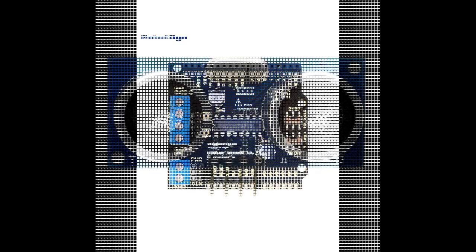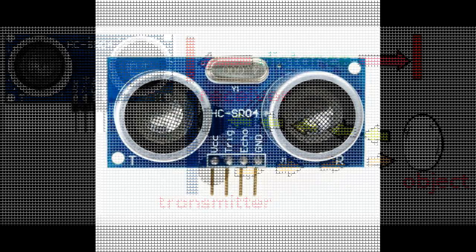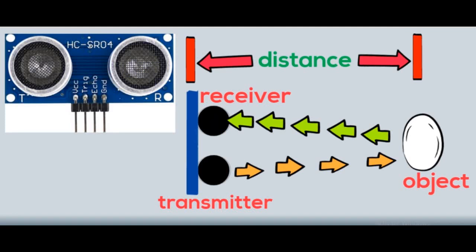As sensor, we use the HC-SR04 ultrasonic sensor, which detects the distance by sending sound pulses and calculating the time of the waves turning back to the sensor. This is used for the robot's gap detecting system. When the sensor reads a farther value than the value we set, it means the sensor is above a gap. Otherwise, the sensor does not see a gap.